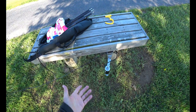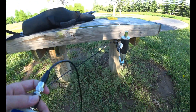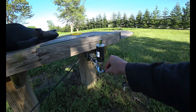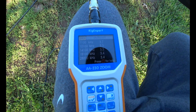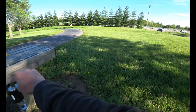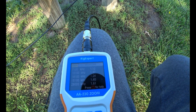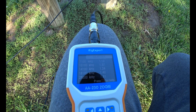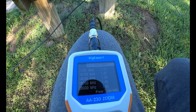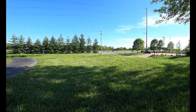For the final test, I don't have an antenna at all and I also don't have the counterpoise. We're at 3.5s, 3.5s, 3.4s - that's to be expected. Touching it to the bottom: 3.7s, that didn't work. Now I attach it to the top - and that's all you need. You would raise that up into a tree, raise it up as high as you can - not into power lines of course - and 1.2s, 1.4s, 1.1s. This thing tunes on all bands very easily, you probably don't even need a tuner. That's why this thing is cool - it pretty much just tunes itself, and I don't even have the counterpoise, it's laying on the ground.